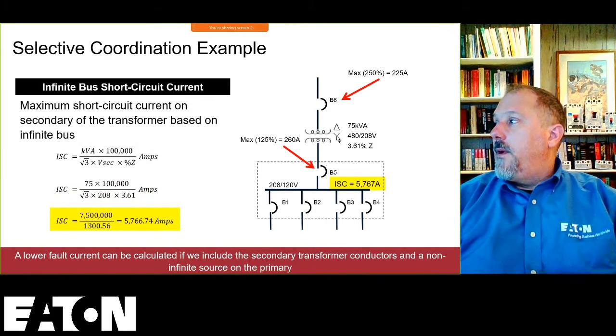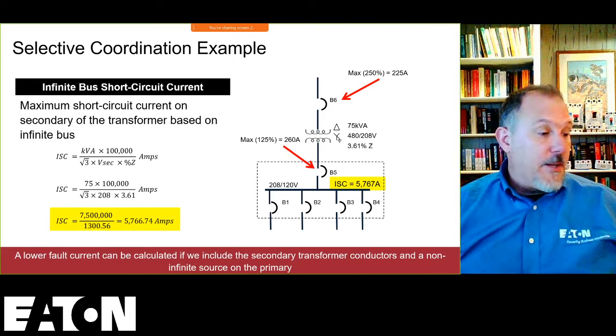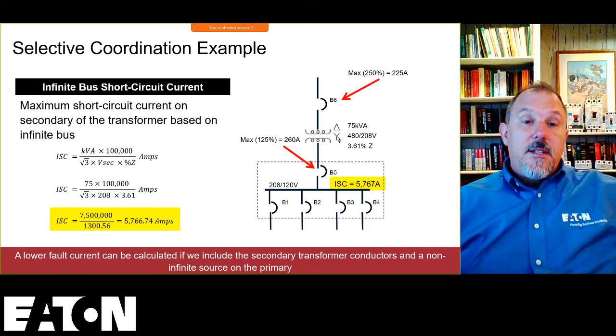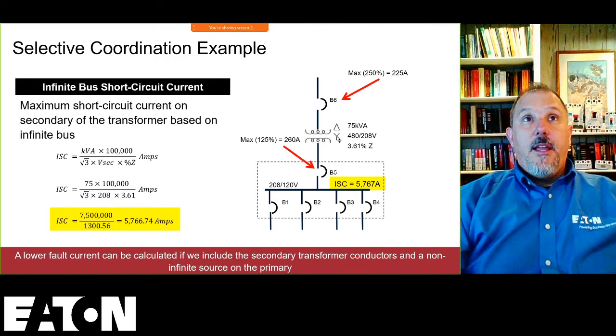All right, so the first thing you want to do is figure out what the available fault current is that you're going to need to selectively coordinate to, because you can't evaluate the overcurrent protective devices without understanding what current value you need to selectively coordinate to. Now, if you think about,